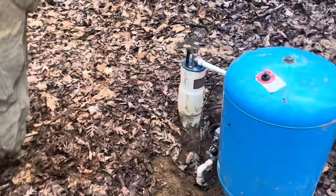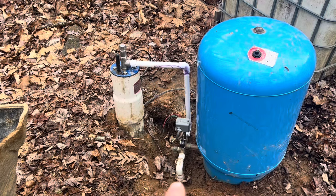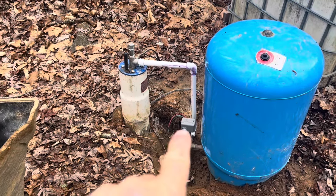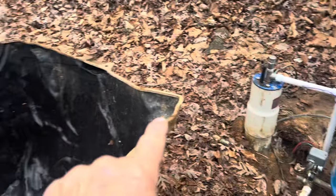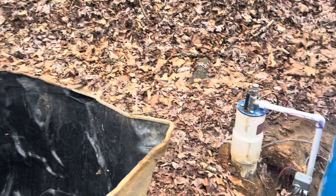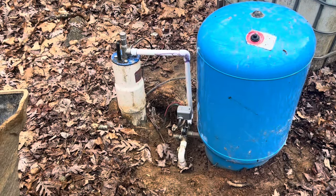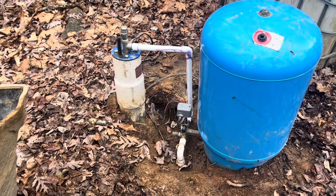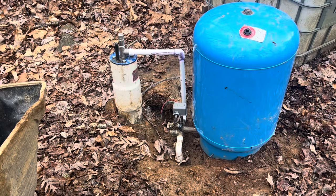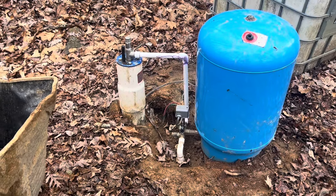So what we're going to do here is put heat tape on it, wrap insulation on it — this foam insulation that doesn't attract moisture — and then run a power line from here over to where the receptacle is and plug it in, because it's getting down in the 20s and teens again this weekend. We're also going to cut the power line and put a plug and receptacle in it so he can power it from the generator if they lose electricity.